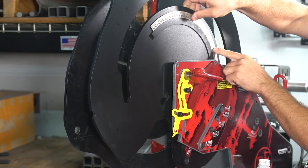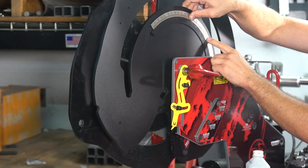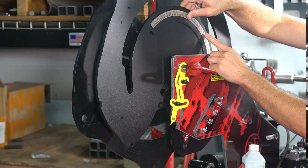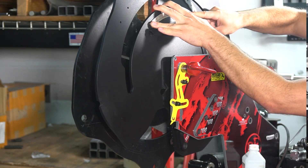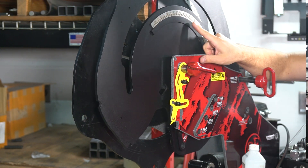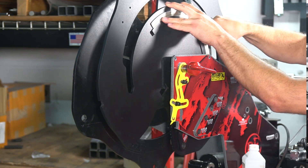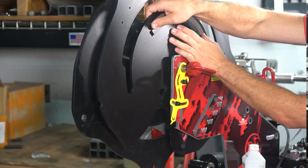Any gap you have between your 94 and 95 degree marks across the two parts will introduce error of that amount for the entire second half of your scale, so the parts have to be touching here — it's very critical. Your scale also changes size if it gets further away from those rub bars, so you'll introduce an incremental error where every degree will be a different size than it's supposed to be.